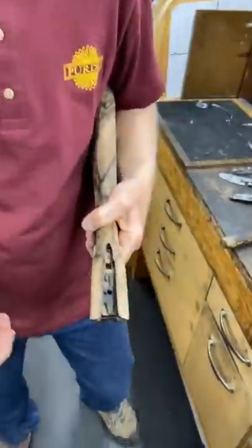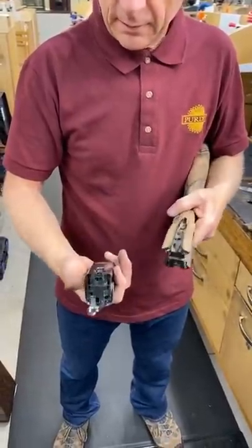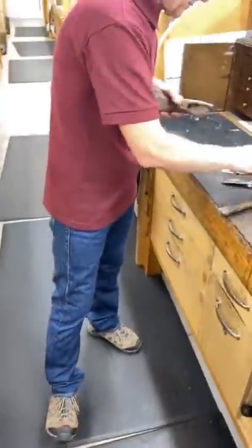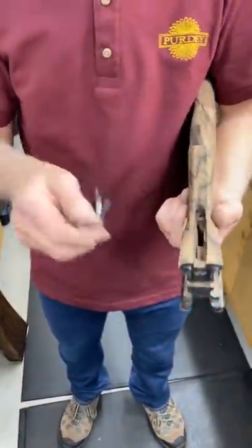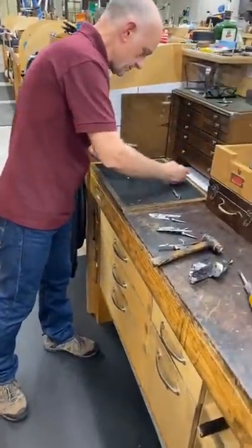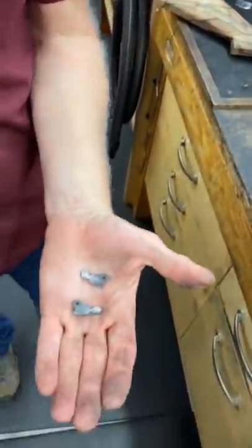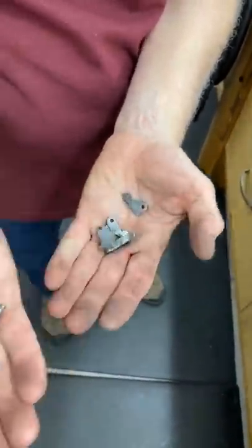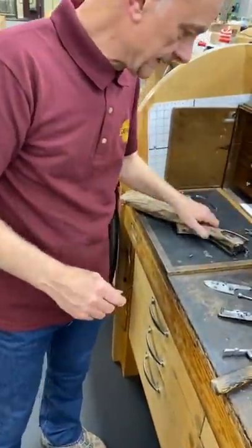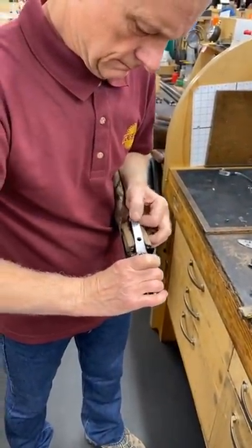Then, same as before. Smoke black, we load smoke black, so the safety slide in the wood and the safety spring, trigger work, all that in the wood, exactly the same, make sure it all moves. This is all, again, all got to be free. And then we're letting in a lot of little parts. So, obviously, cams that cock the gun we let in, lever spring, strikers and firing pins, same thing. Bob weight, all these are let in one at a time separately using smoke black. So now we should have, I'll put it back together again.